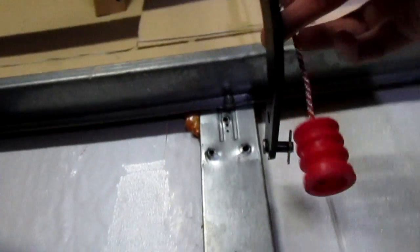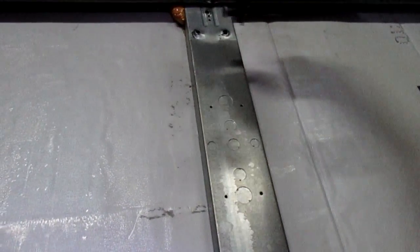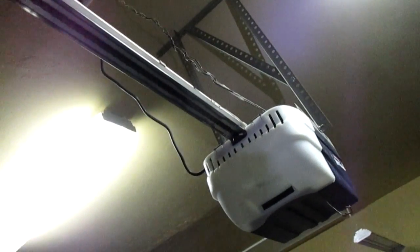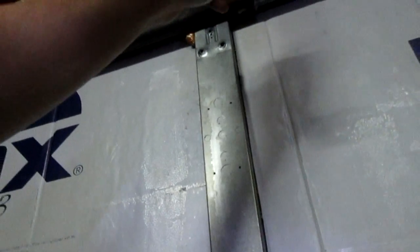This should be free-floating right in the middle of the door, and it's not. No power, it's hot — screwed up place. The wire runs on top of there near the sensors, right on top of that rail. You see where it's kind of taped — it was all hanging too, hitting on it and getting chewed up. Whoever built this place was just a bozo.